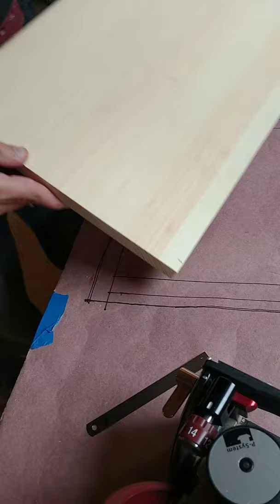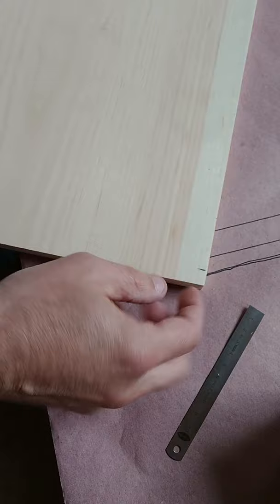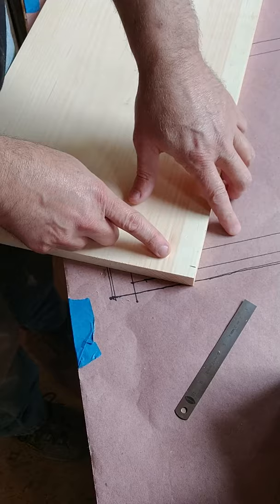This is my inside, and holding my little metric ruler up against here — this winds up being about 11 millimeters, so that's what we're going to declare our offset to the bottom of our shelf. This is a good example of showing how our stop square works.